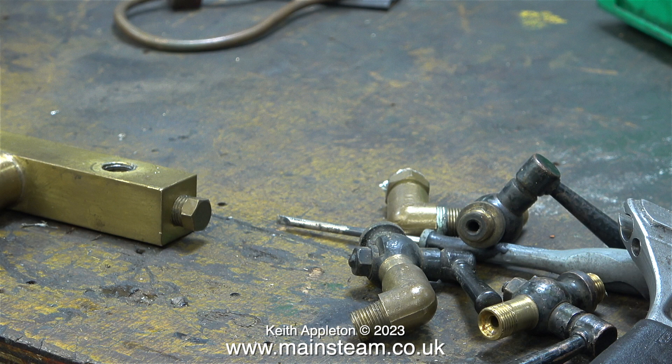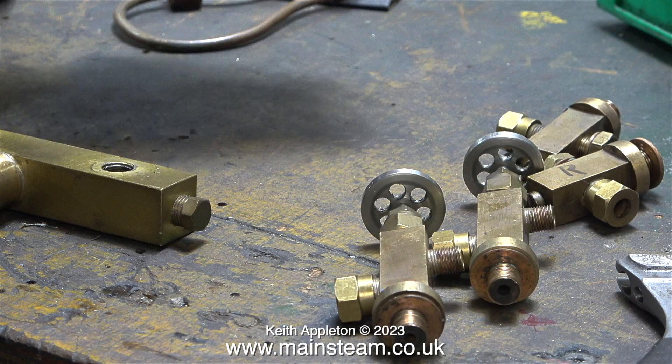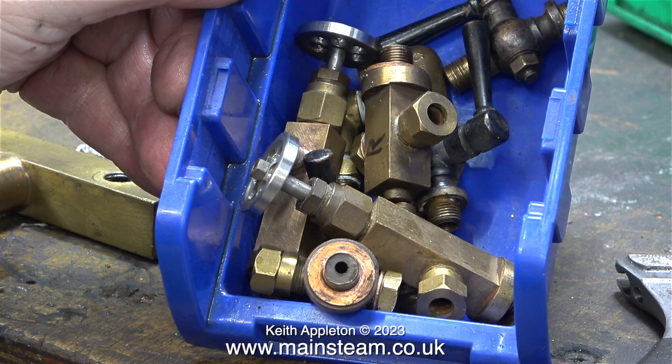I'm not going to reuse any of these taper plug taps — they will be replaced with commercial fittings. To the right of the turret, on screen at the moment, you can see the water gauges. These are completely unserviceable as far as I'm concerned, and in their place I'm going to fit commercial 3-cock water gauges. The thread on the end of the new water gauges needs to be the same as on these: 1/8th BSP. I think I'm going to need a bigger scrap box — there's quite a way to go yet and the scrap box is nearly full.